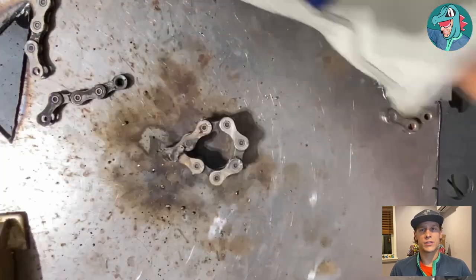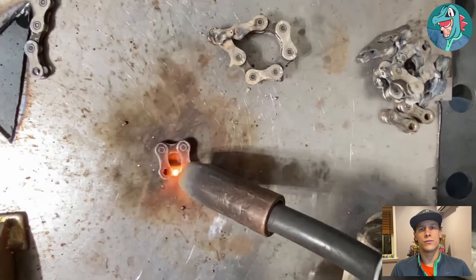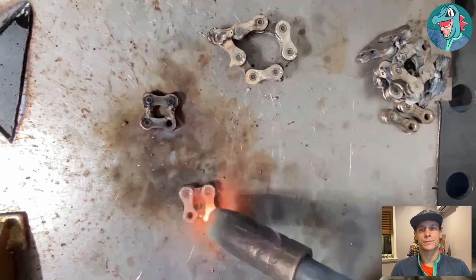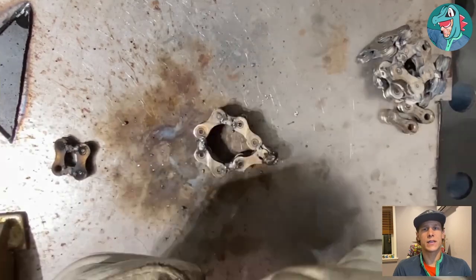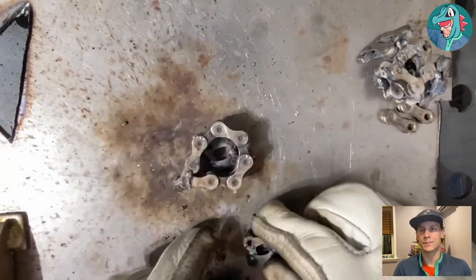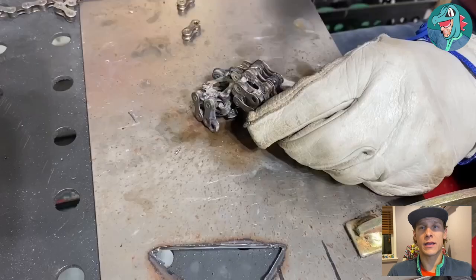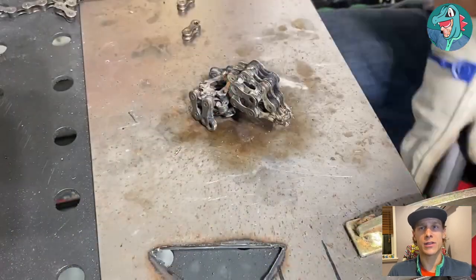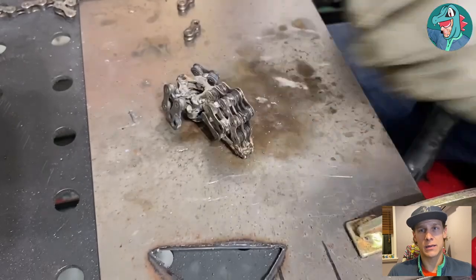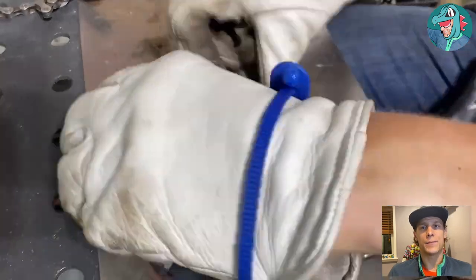The main portion of the head is two side-by-side eight-link pieces giving him a shorter nose, then using two four-pieces to create squares that go on the side to finish out his head. Once they're on, I give them quick tacks on each corner to secure them, then flip it over and do the same on the other side. Once the head is secured, I add it to the main body — one quick weld first to make sure everything lines up, then stronger welds on top and bottom. The arms are small overlapping two-link pieces; they also serve as supports because Cinder Quill is very top-heavy.